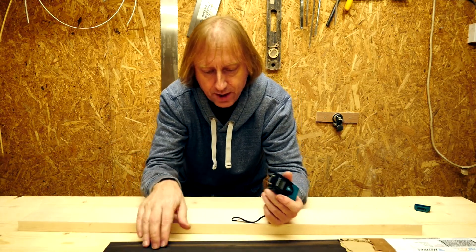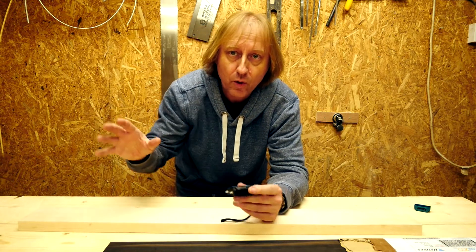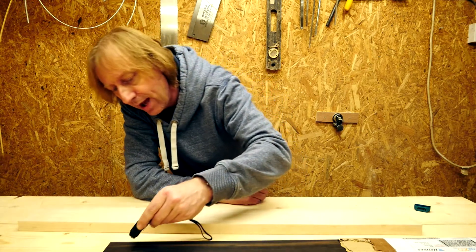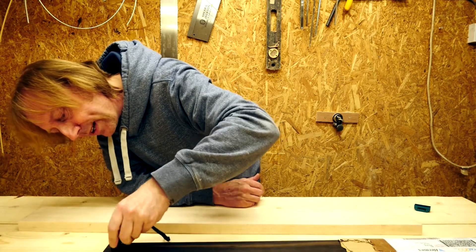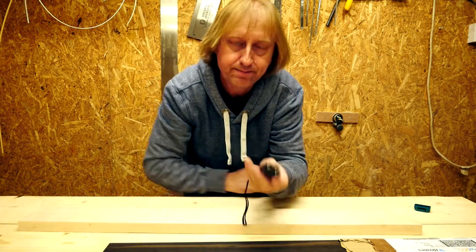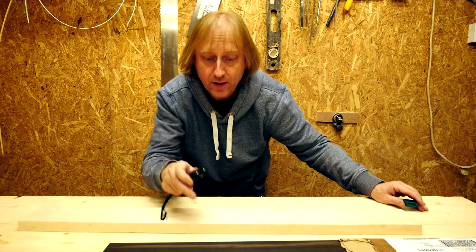The other piece I've got here is a piece of ebony, and this has only come today so it's not yet adapted to this environment — it's direct from kiln drying where it was stored by luthier supplies. Let me get this in properly — it's quite hard. That's showing about 7%, so you can see the workshop here is more humid than where this piece was stored by my supplier.